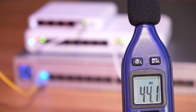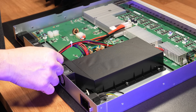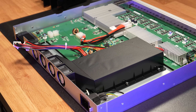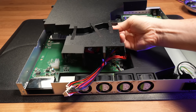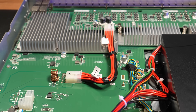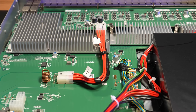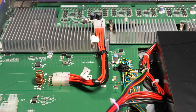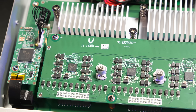It's actually rather quiet. That made me curious what was inside, so I opened it up. The plenum and the way the fans work in these UniFi switches looks well engineered. It has quite large heat sinks, and those large heat sinks combined with the plenum really pull the air through it. Even at the back, it isn't that loud. Of course, this will change as temperature rises or as you have all 25 ports in use and are pulling a higher PoE budget. Overall, I think it's well designed and I've not had any problems with UniFi fans or power supplies internally failing.